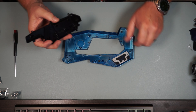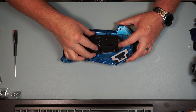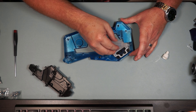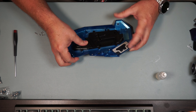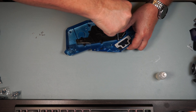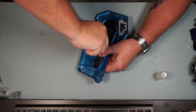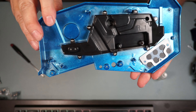Now we're going to put this part on and fasten it down with eight PWM 2x6 screws - it's going to go right here. We're going to put a little oil on there first. Let's go ahead and sit this on here, and remember on this one we're going to have this piece that's sticking out this side so it's not going to be able to sit flat. Let's get a couple in here and there and get the rest screwed on. There's all eight screws, it's going to look like that.